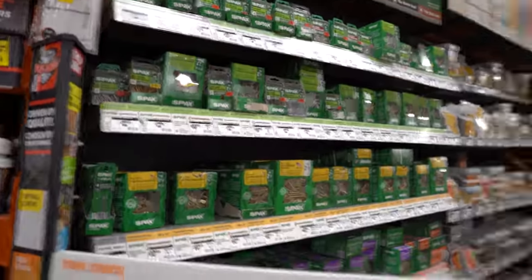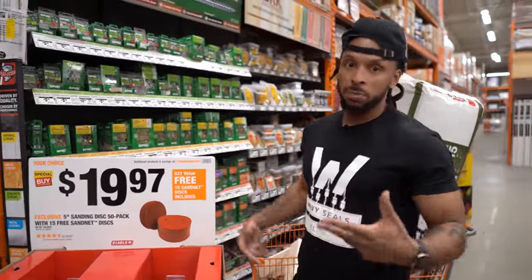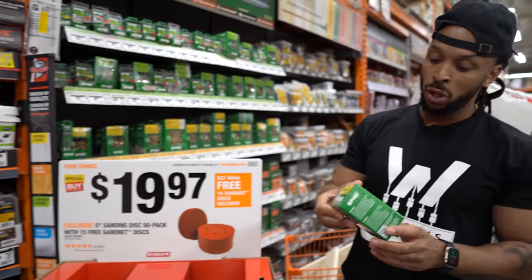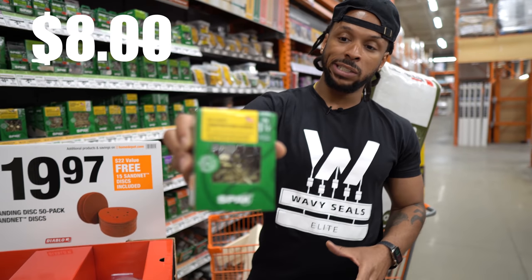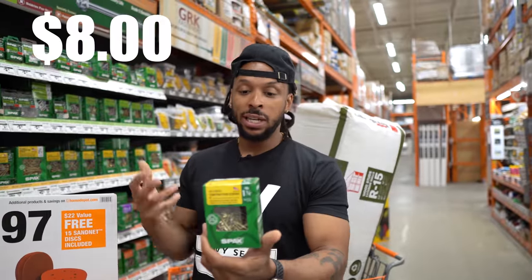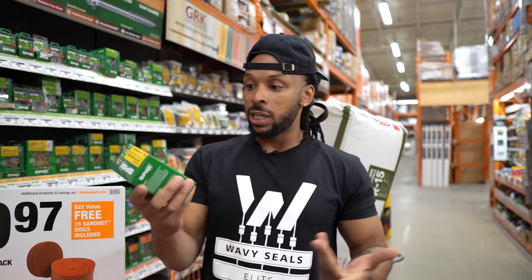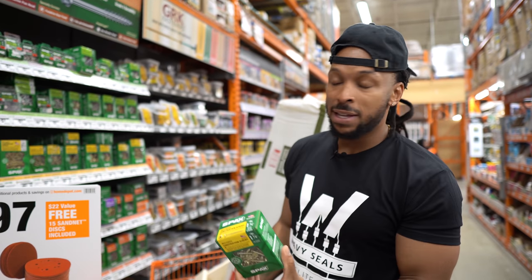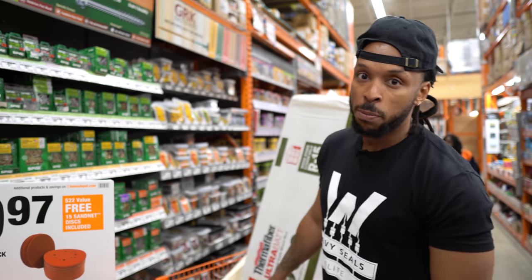So when it comes to the screws, we just want to look for some basic, multi-purpose construction screws that's definitely not too big or too long. I'm gonna choose these 1 1/4 inch screws. This will be more than enough to get through the wood that we have and make sure that they all connected, okay? So just a box of 1 1/4 inch screws. You probably had some of these laying around, but if not, just pick up a little extra box of those, and that's what we're gonna use to put our frame together.